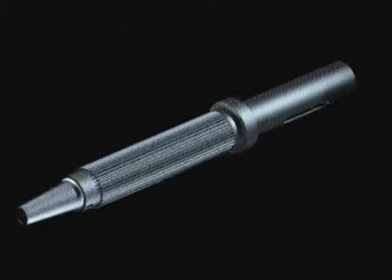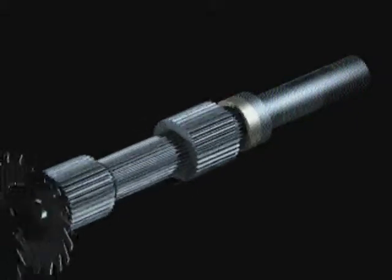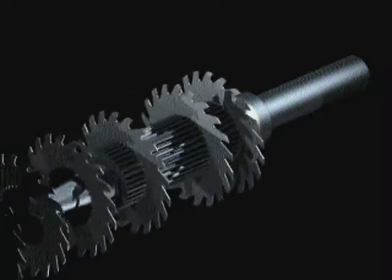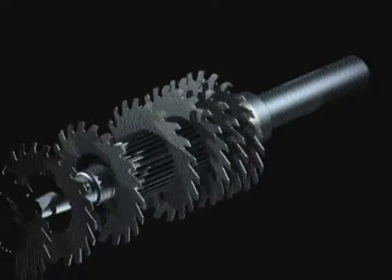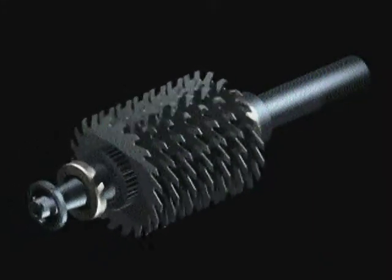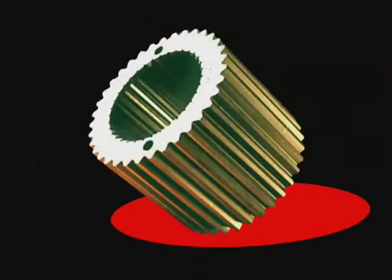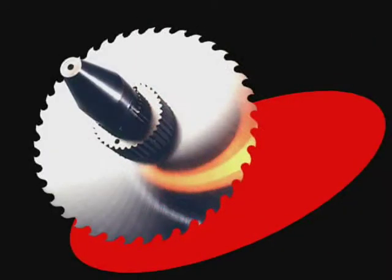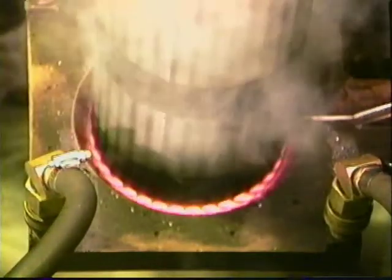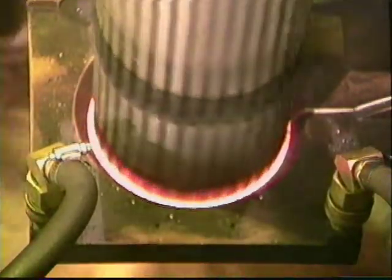Vancouver Gear Works has developed and completed testing on its next generation of arbor systems, named the Ultratech Universal Arbor. This patented, versatile arbor overcomes the problems associated with previous designs and further increases sawing performance. The system consists of a precision-balanced splined mandrel, multiple universal involute sleeves, and hardened saw blades with machined saw eyes. The dynamically balanced splined mandrel increases arbor strength and reduces bending of the arbor.